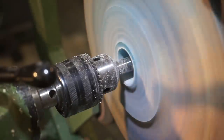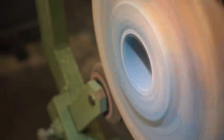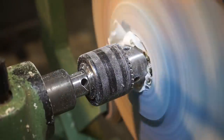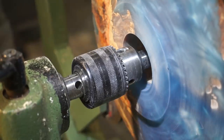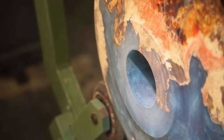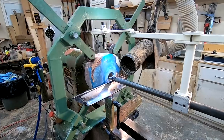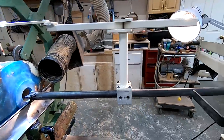I think this is a three-quarter inch drill bit and then I switch out to an inch and three-quarters - the larger one is actually sharper than the smaller one so it seemed to work better. You'll see me using a brass punch, reaching into the bottom and eyeballing it on the top to make sure that I don't go through the bottom of this thing, because at this point that would be devastating - a lot of time, money and effort has gone into this piece.